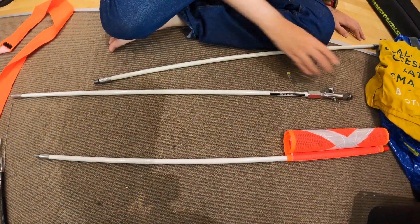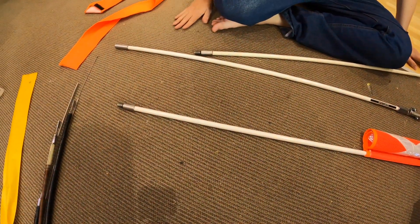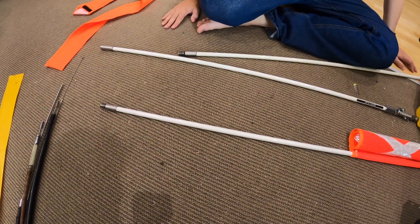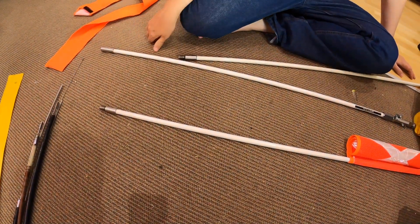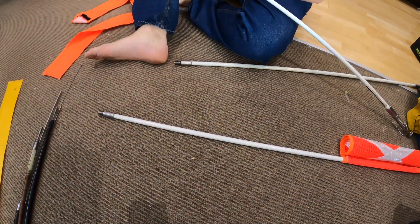If it could be both, it wouldn't collide with the 30-meter antenna when it's also mounted on the front right of the bull bar. How hard can it be? We run a wire up it, we add a coil, and we adjust, looking at the nanoVNA until it's got an acceptable V-SWR.